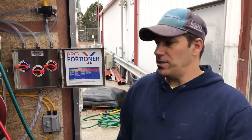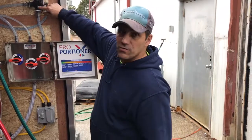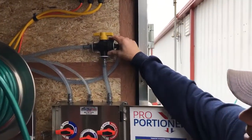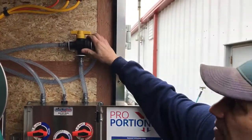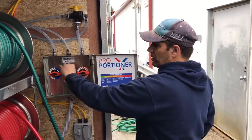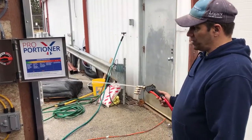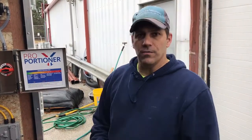Now with this system you should be able to maintain prime as long as you don't run out of any of the products. If you do end up losing prime in the system, two things to check: one, if your level is too low and you happen to get a little bit of air in there, or you have an air leak somewhere in the system — either from a connection or a valve. One of the things with these valves is you can actually loosen and tighten this collar, which will allow it to make it easier to turn the valve, but if it is too loose you'll actually get some air in that system. So once it's primed, it should keep its prime. At the end of the day I like to just turn the valves off — there are check valves installed in the system so it won't backfeed into your tank — and then just give it a squeeze to let any pressure off the system, and you're all set. So that is how you prime and operate a booster pump with a proportioner, from PowerWashStore.com, 855-351-9274.